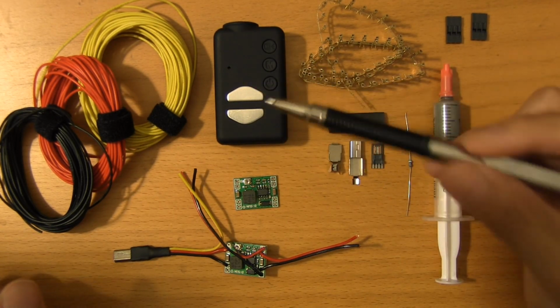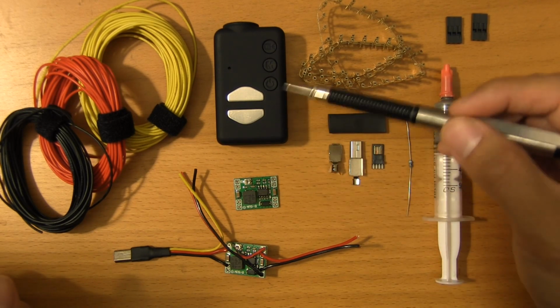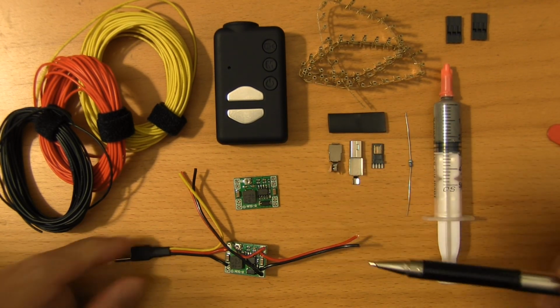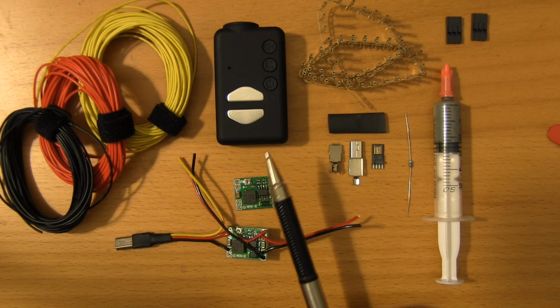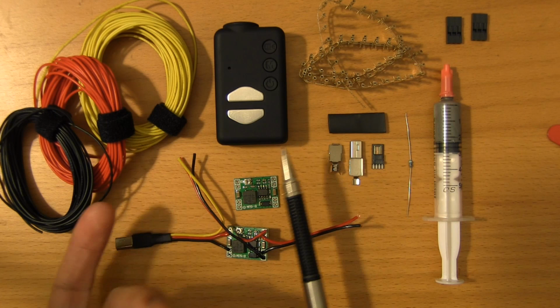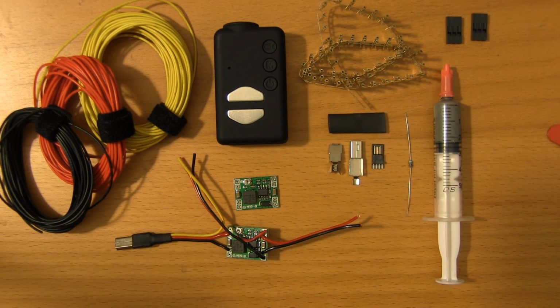So anyway, what we're trying to do here is we need to create a cable for this Mobius Actioncam that does a couple of special things. First of all, it'll be responsible for charging the camera during flight, so it'll be providing an active power source to the Mobius, but it'll also be providing a video out from the Mobius to a video transmitter. That's not always going to be the case, and we'll put the video out cable in there just in case you want to use it.